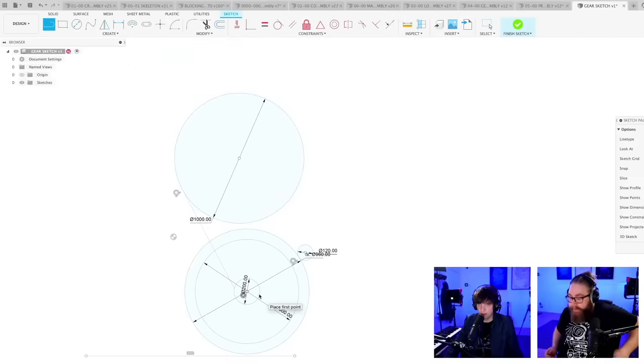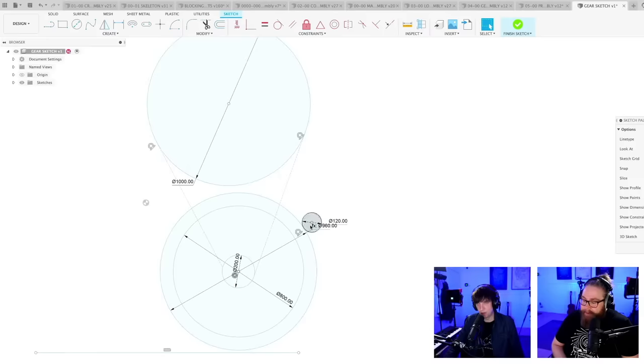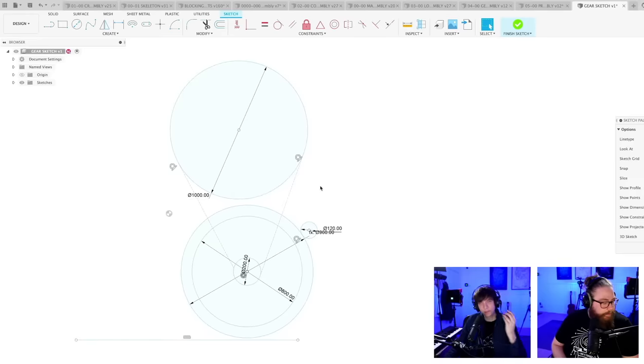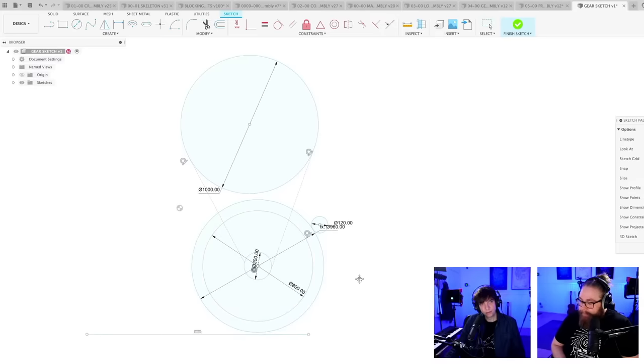So if we did a timing belt, which direction would the programming wheel go? I think it would go in the correct direction then, right? Yes, it would, because this is going clockwise and this is going counterclockwise. That would actually also solve the rotational direction of the programming wheel. And it's a very efficient gear train, actually.